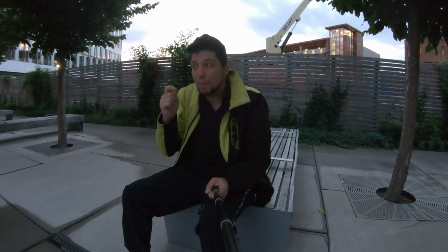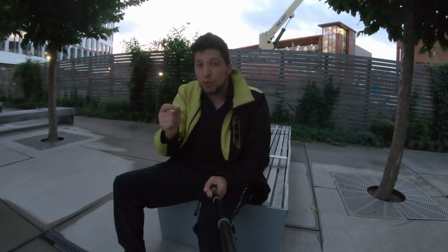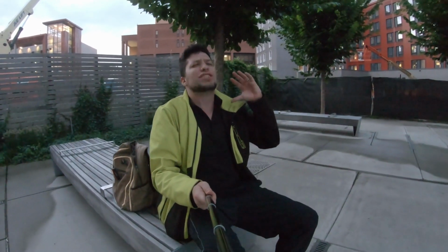If you try to plug a 110 volt appliance, in this case a charger, into a 220 volt system, you're gonna have a bad time. But seriously, it's gonna probably pop and explode. There's gonna be a fuse or a capacitor that goes almost instantly. I mean, you're gonna barely touch it and boom, it's gonna fry. So the ewheels charger does not give you the ability to plug into a 220 volt system, period.